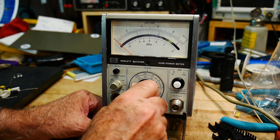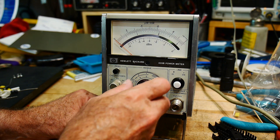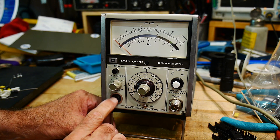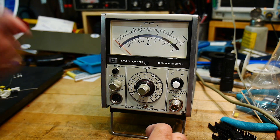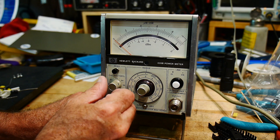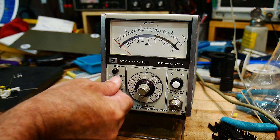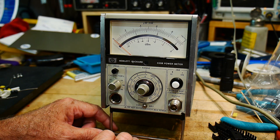It goes up to 100 milliwatts. It has a 50 megahertz 1 milliwatt output for calibration, and you adjust the little knob at the bottom to calibrate the meter. There's a cal factor — the diode detectors have a little chart on the side. At 50 megahertz you have 100% of the signal, but at 1 gigahertz you only have 96%, so you put this on 96. At 18 gigahertz you only have 90%, so you put this on 90 — it fudges in the cal factor. The modern meters are all automatic now, but back in the day you had to change it yourself.